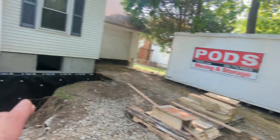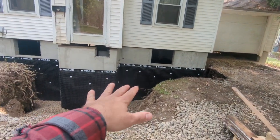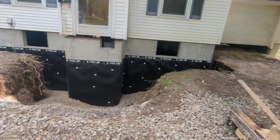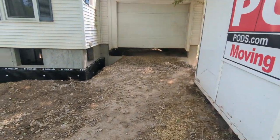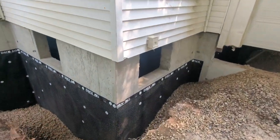I don't like that stuff getting in close to the house. Just as a best practice, we want to keep that engineered. Certain amount of stone, certain amount of gravel soil, and try not to have any, even the little tabs broken off from the foundation and nails and stuff from the form boards kind of bug me in there. I know they'll rust away, but try not to have any big stones or roots.